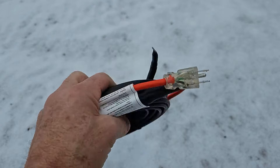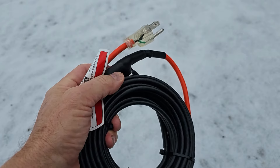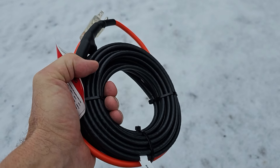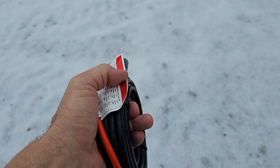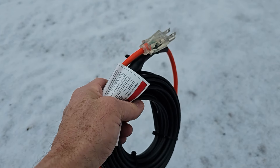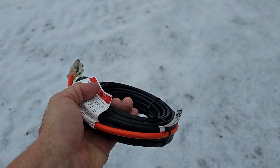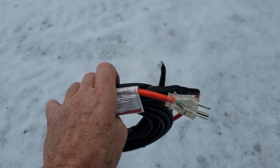I really like this one — it checks all the boxes for me. I don't leave these plugged in because all of these with self-regulating thermostats usually turn on once you're below 50 degrees. When this is in an underground buried downspout, it's sealed and insulated — it's going to get so hot it'll burn up. So I want to only plug this in as needed. If we're below freezing and not going to go above freezing, we have blue sky and the sun's melting snow on the rooftop, I want to make sure my underground system is working.